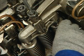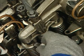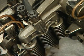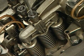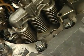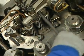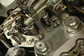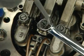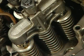On both exhaust valve bridges, with the lock nuts of the rocker arm adjusting screws loose, turn the adjusting screws down until the last valve stem touches the lash adjuster. Use a 0.001 inch feeler gauge so that it is just snug between the valve stem and the top of the adjuster plunger. Remove the feeler gauge and turn the adjusting screws another one and one-half turns. While holding the adjusting screw in position, snug the adjusting screw lock nut. Check to ensure that the valve bridge spherical seats are spring loaded against the head spherical seats. If the valve bridge spherical seats are not spring loaded and are loose against the head spherical seats, turn the adjusting screw down another one-quarter turn until there is no movement felt in the valve bridge. Once it has been determined that the valves are not being held open by the valve bridges, tighten the adjusting screw lock nuts holding the adjusting screw in position.